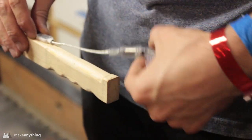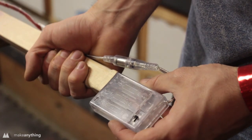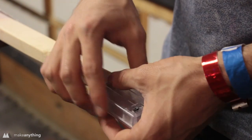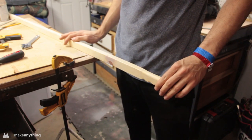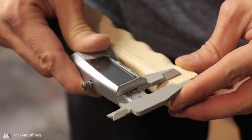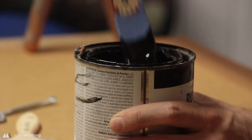Here's the battery pack for the LED strip. This product comes with both a battery pack and a USB cable, but I want it to be portable so I'm using the pack. The pack also has an on/off switch, which the USB cable doesn't. I figured I'd have the battery pack butt up against the bottom of the stick, so all I need to do is print a connector that fits both parts. The stick is basically done — I just need to paint it black so it won't show up in photos, but first I used calipers to measure the length, width, and depth of the end so I know how to make the end cap.